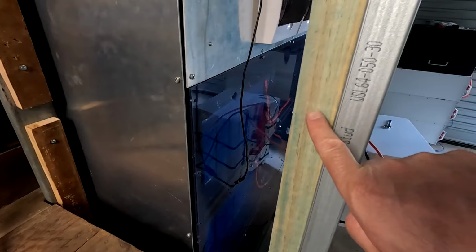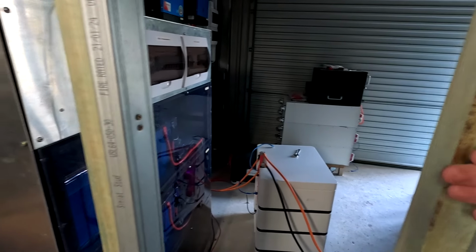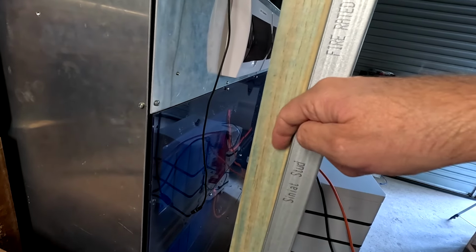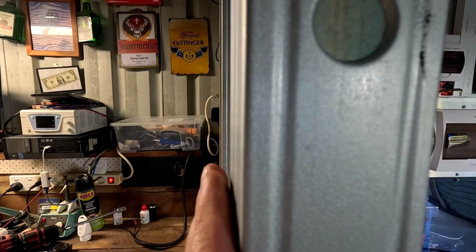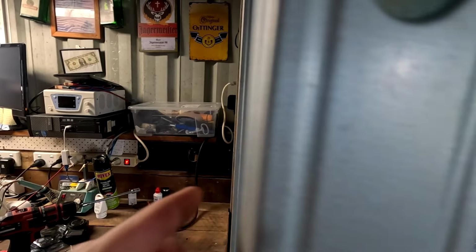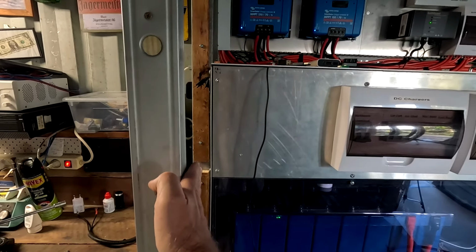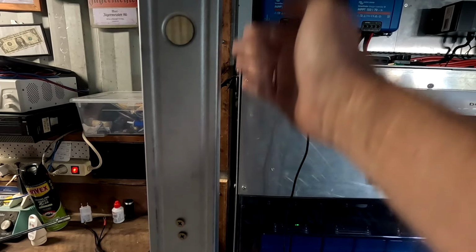And I don't actually think I need this piece of timber here in this stud anymore, because initially I thought I'd stop with the plasterboard over here and then put another sheet up here. So I've got a bit of a step in between, but the idea of putting a bend in it is much better. Cut it on one side, take out the plaster a bit so it can actually bend, and nobody will see that. This one here goes straight to the metal beam at the end, while this one doesn't. So this one goes straight up until here, and then the plaster will do a little bit of a bend, so it fits into the gap and sits against the wooden stud.